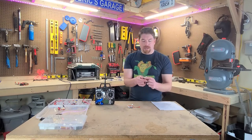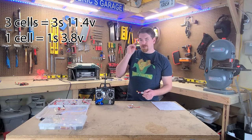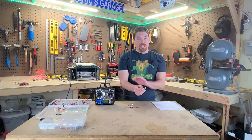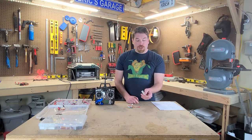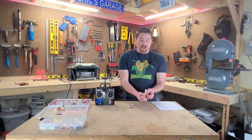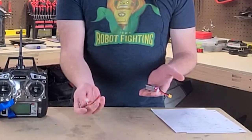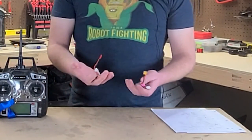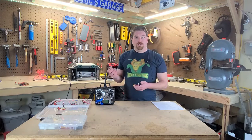This battery is 11.4 volts combined. I'll put the cell breakdown up on screen. The voltage adds up as a combined series. If you're plugging into a charger, you want to make sure each cell is filled to its maximum — use a charger balancer for that. A two-cell will operate similarly but at a different voltage. More cells means more voltage. You also have a milliamp hour rating, which determines how long the battery lasts. Those are the two major factors: voltage and milliamp hours.